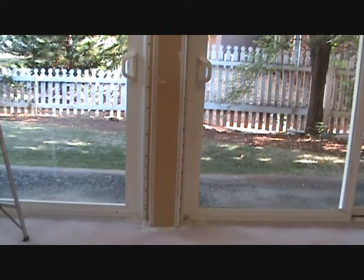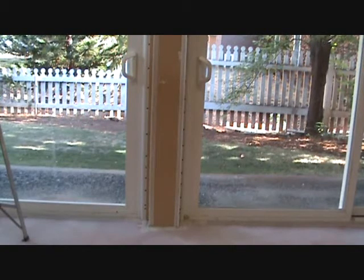I'm going to put some webbing tape down on one of these corners prior to installing the sheetrock mud. It's a good habit to get into. I can't tell you how many times I've seen people's outside corners with a hairline crack, because there's no tape there between the outside edge of the corner bead and the sheetrock.